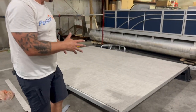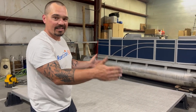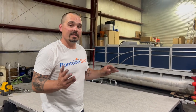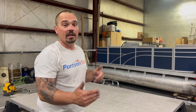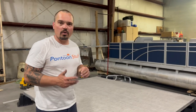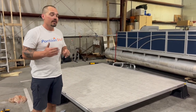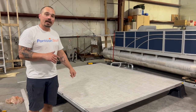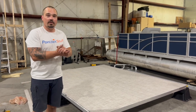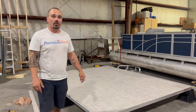This floor is on this upper deck. The way you saw us start on one end, roll it back, and work our way forward in sections - we did about 36-inch sections. That is how I would prefer to do it on any size boat, whether it's 20 foot or 28 foot. You're just going to keep working in chunks. With two of us working, how long did that take? About an hour of gluing. This is 10 foot long, so it might take you a couple hours. If you get a few people working at it, it's going to go a lot faster. This is ready to go now - we can start working on it pretty much right away once that adhesive is stuck together. Thanks for watching. Please subscribe, like, and share this with any groups you're in or any of your friends who are working on their pontoon boats.